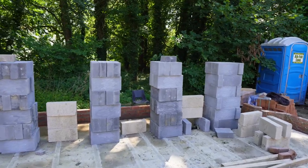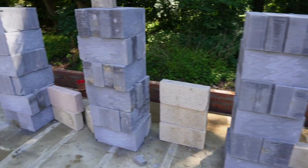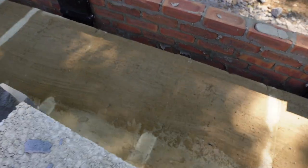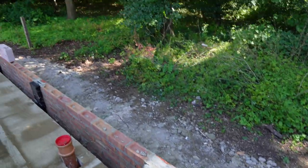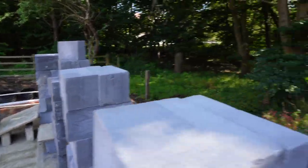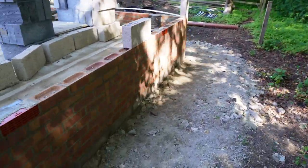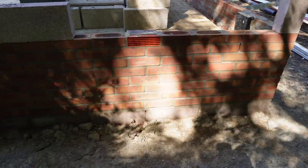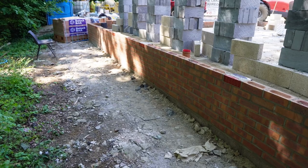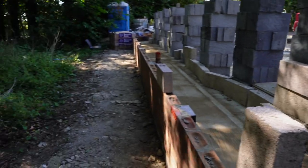A couple of nice big piers on the garage - I was a bit worried about them because they've got to support some attic trusses, but looking at that it's a big old lump of a pier which is good. I've made this a nine-inch wall through here rather than poxy sort of garage piers dotted around, just made it a solid nine-inch wall. When I come to convert it I can batten it out and insulate it and make it into a habitable wall room.